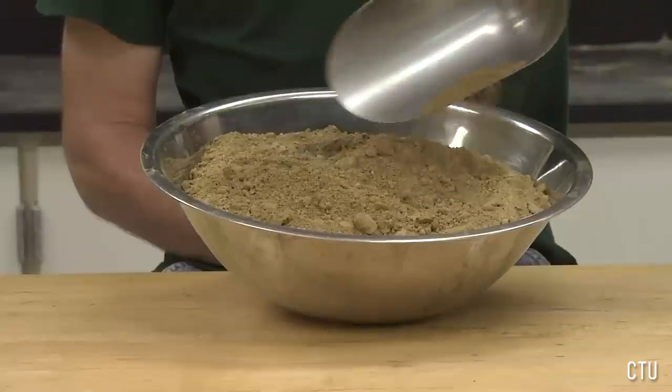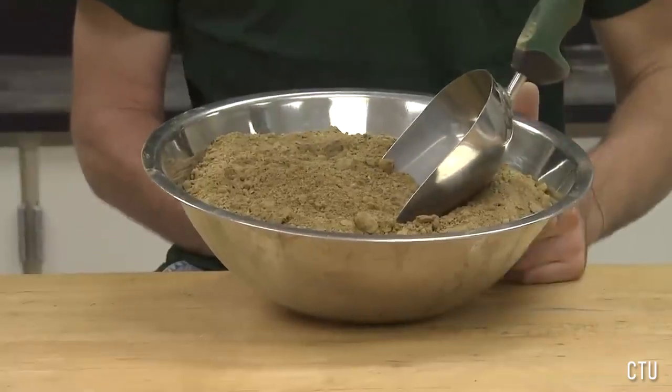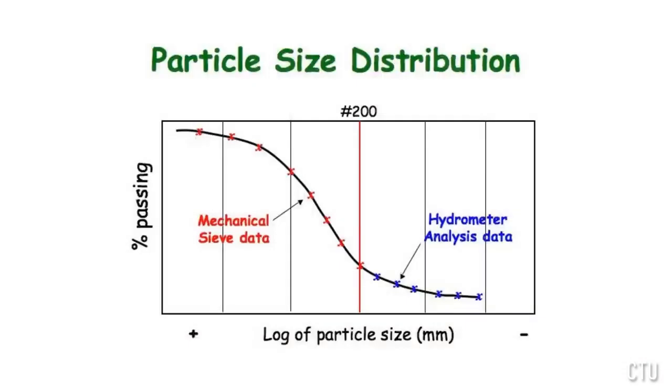The soil that we will be performing the standard Proctor compaction test on is a loessial silt obtained from the Mississippi River Valley. The soil has been mechanically pulverized, then air dried. By conducting several standard Proctor tests at varying moisture contents, this curve can be established, and the maximum dry unit weight and corresponding moisture content can be determined.